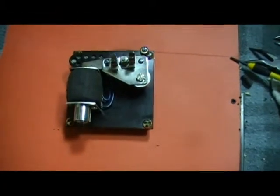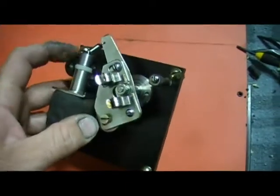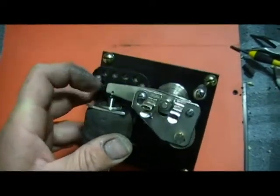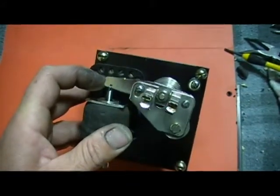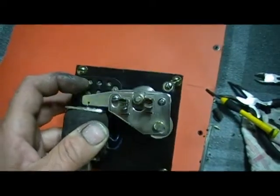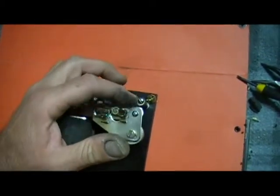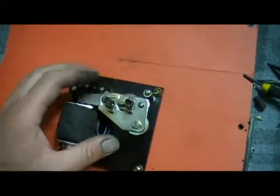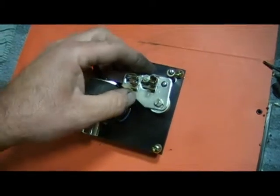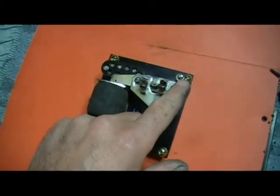Well, it's raining steadily now outside. A couple of hours later we have the almost finished product. I've put the new washers in, and a new spring because the other spring had lost its spring — I checked the tension and was worried it was actually going to snap. So it's a lightweight spring; I assume it's for some sort of shock absorption. We'll find out when the thing's tested. This adjustable cam here turned out not to be a rubber grommet but actually a brass adjustable cam, and it's got a new rubber sleeve on it. Everything's been cleaned up and it's all back together. So really all we've done is clean it, put in a new spring, new nylon runners, and a new rubber buffer.